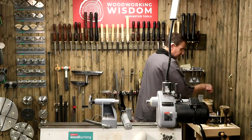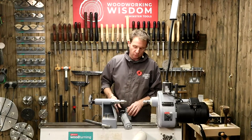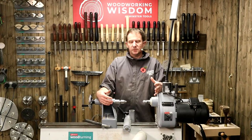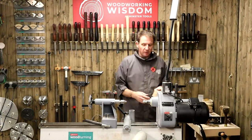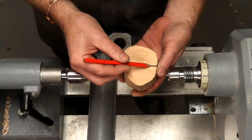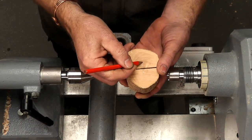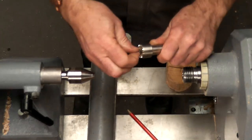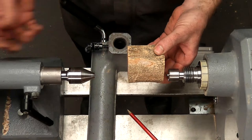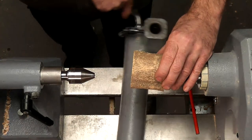I'm going to set the lathe up. Because I've already made one, I'm reconsidering how to mount this - it could involve using the chuck a little bit more but might be more user-friendly. I've got that bandsaw cut in there. I've got an idea to run across it the other way, parallel with the lathe bed, to get maximum diameter. I'm going to put that on the pro-drive we used last week - spring-loaded with lots of teeth to grip it. I mounted it the other way originally but it caused more aggro fitting the ferrule because I had to move the tailstock.